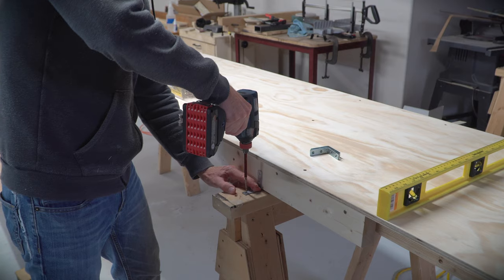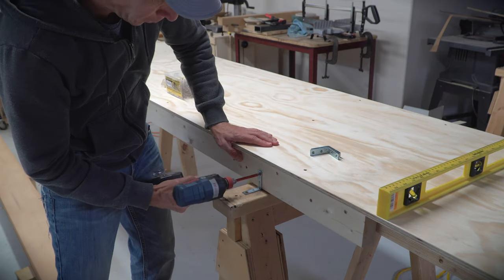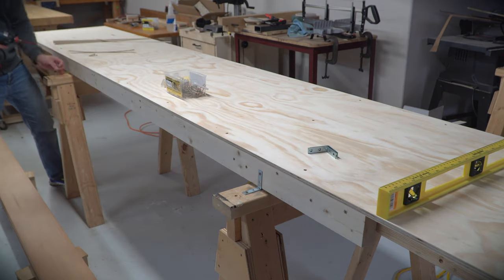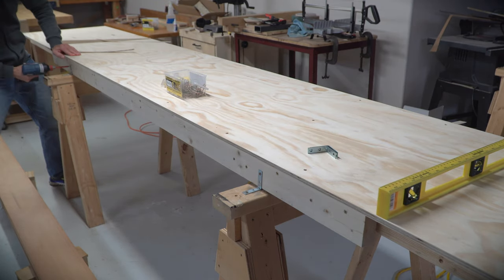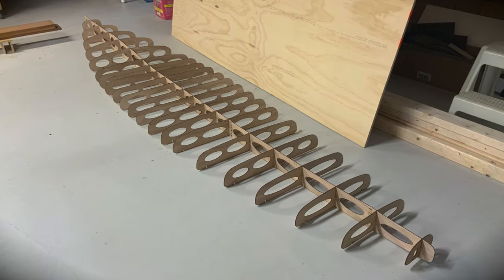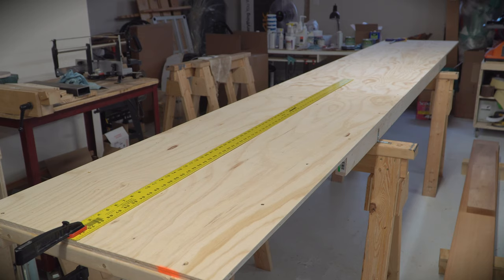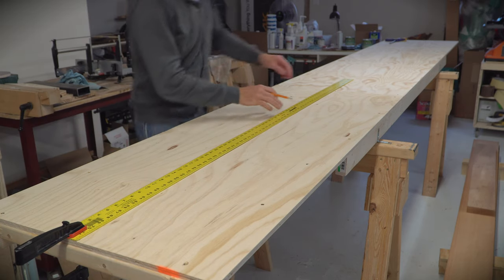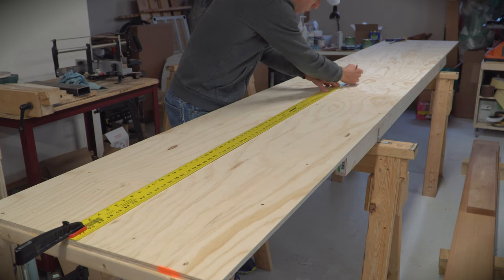Later on in the build, I found that the whole assembly was prone to walking itself along the floor while I was sanding or applying some pressure to the table. Tying the two sawhorse legs together with a big steel bar that was laying around the shop fixed that problem. One thing I noticed with the frame kit is that by itself it's really thin and floppy. To make sure it all comes out straight in the end, I wanted some guidelines drawn on the table so the main spar and the ribs of the kit can be lined up and squared before adding any strips.